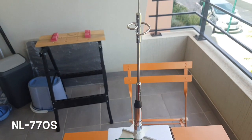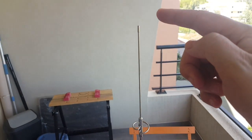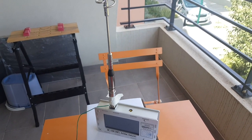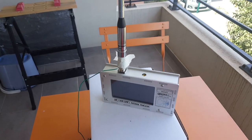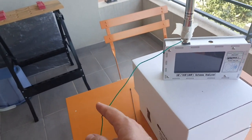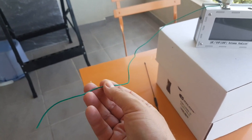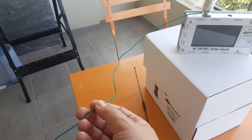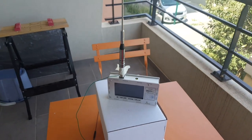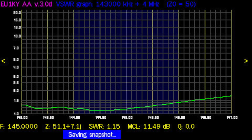The first one is this model with the center coil. They're both very short, about 50 centimeters, so a quarter wave. I'm measuring the SWR with my antenna analyzer. I added a 50 centimeter quarter-wave wire to simulate the body of the car. Of course this is very far from being scientific, but it will give me an idea about the performance.